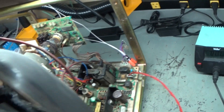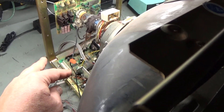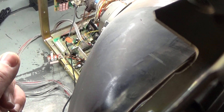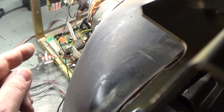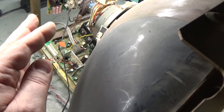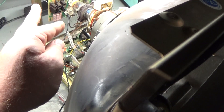Since I don't want to burn that in and something smells too — yeah, something is very wrong. Since none of our major normal components that cause collapse are bad, I'm going to cap this, put a new flyback in, do a bunch of reflow and my normal solder work. If there's anything I see that obviously causes this, I'll show it. If not, when I come back, the reflow will be done, the cap kit will be done, the flyback will be replaced, and the neckboard rework will be done.